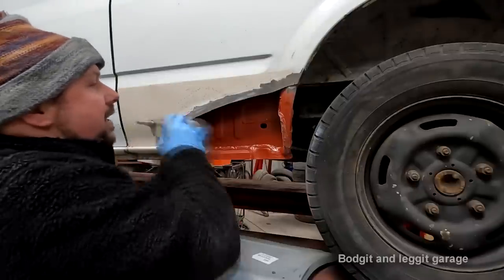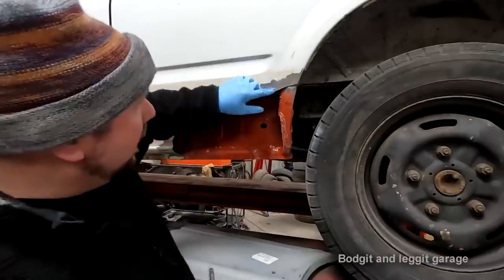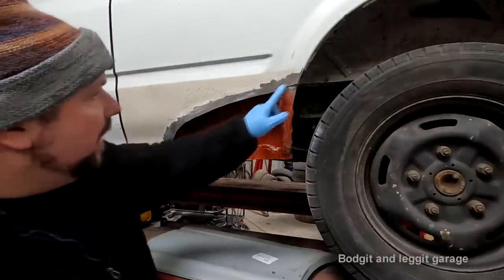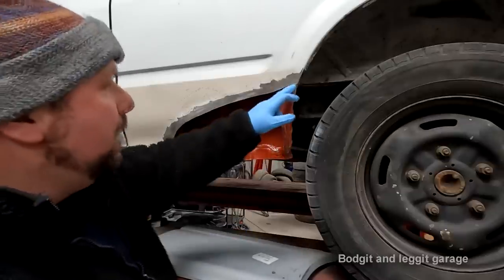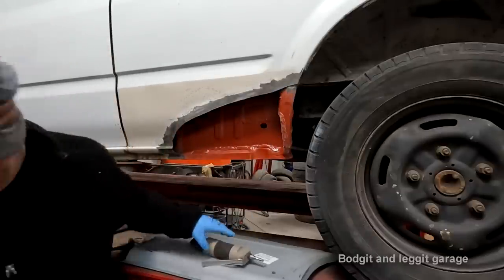Now I'm only going to get into there, so I'm not going to be able to go past there. So from here to there, and there and there, is going to be a butt joint. But again, I'm still going to use that 1 mil gap. So let's get this joggled.